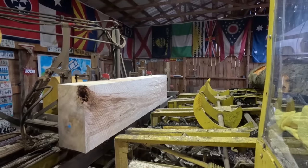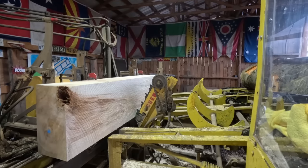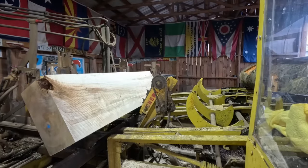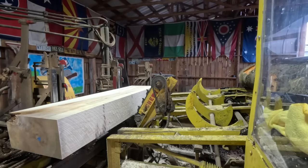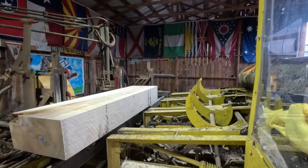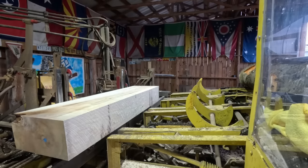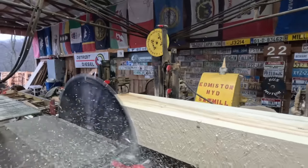All right, let's lay this down and start working. Now I'm gonna try to back the knees up here slightly. Then you set the knees, run back, and then boom. Nice. Then at this point, you always want to put your dogs in. There was a guy argued about this a couple videos ago. He don't understand why you would put them dogs back. Yeah. Well, if you don't, that saw blade will. Okay, we're looking for a little glimmer here. And there it is. See the little flicker on the face there? Yeah. That's about what you need. Little man glitter.